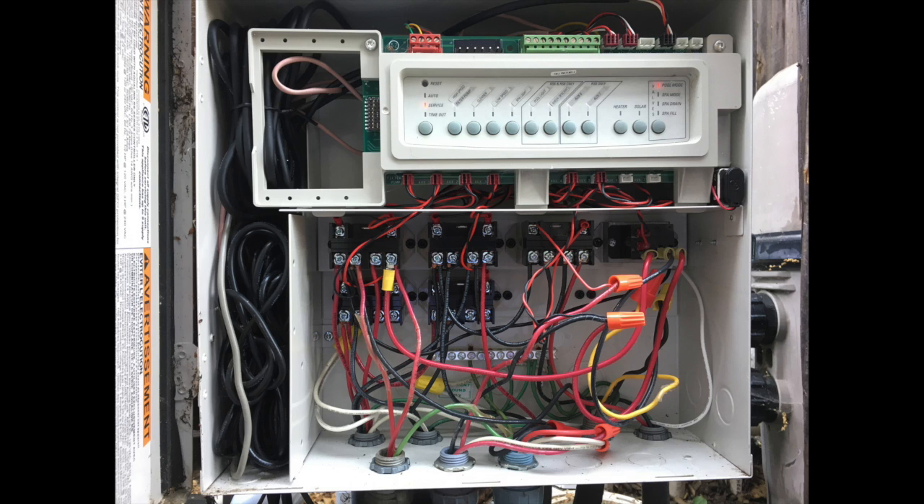The question is why, because as far as the control system goes, this thing should be turned on. When I followed the wires going to the relay back, I found they're not entirely coming from the AquaLink system — one of them has taken a little side trip and goes down another pair of wires.